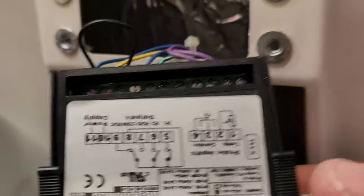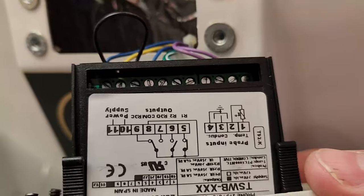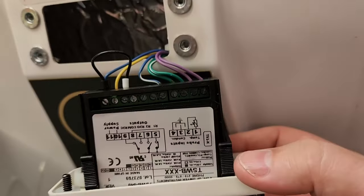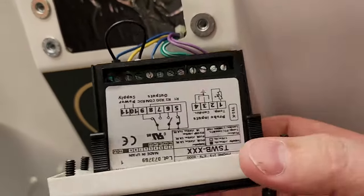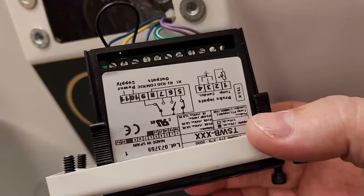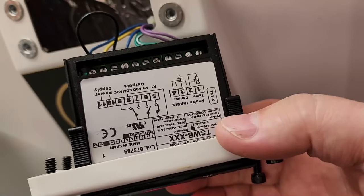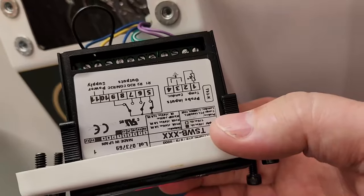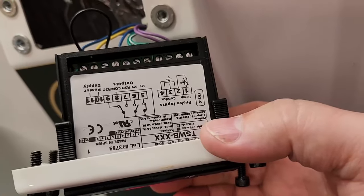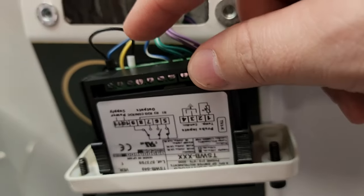I guess we should start out by discussing the wiring. You can see I have one jumper right there on the power supply that goes over to Terminal 9 — really weird. I took a photo of the original old unit that shorted; it actually caught fire on a live stream. And that is how it was wired, oddly enough. So it disconnects at Terminal 9 and Terminal 5 — both are disconnected. You would think it would be connected to Terminal 8 and then Terminal 5 or 9 would be switched, but it switches both ends of the connection.